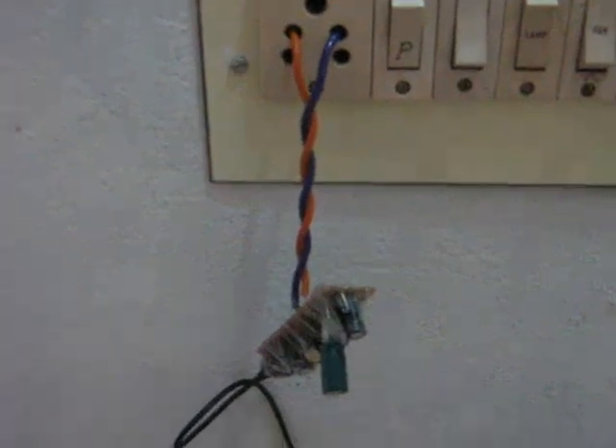Now this works. The bottom line is that in most cases the Nokia charger gets damaged because of a bad electrolytic high voltage capacitor. So if you can just replace it, it will start working. Thank you.